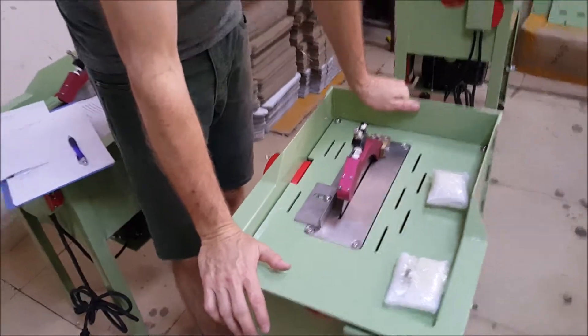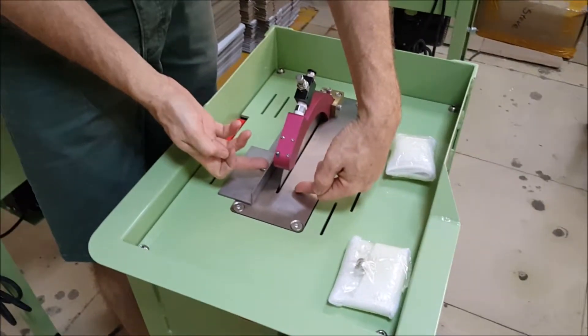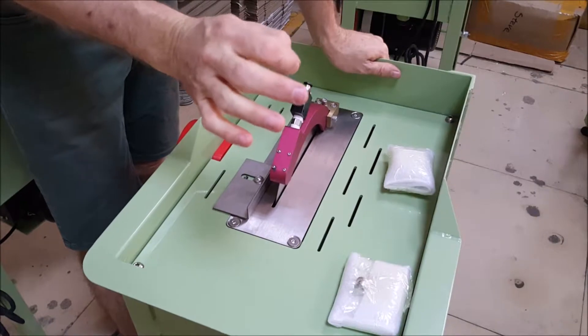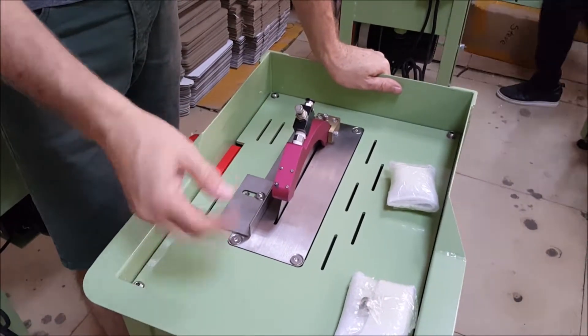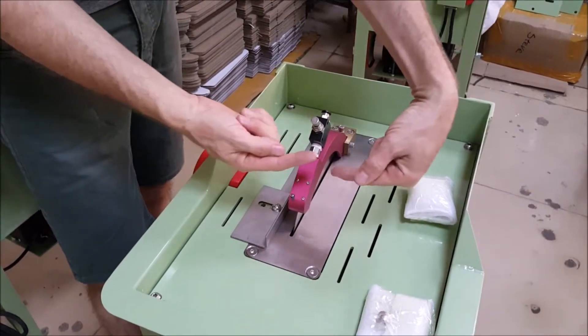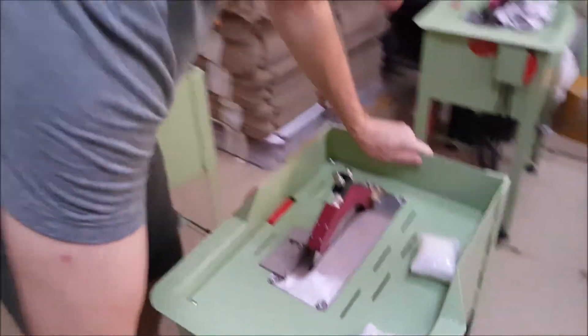Now when you fire up your PT, you're going to hear a scraping sound, which sounds like this. And you hear that kind of scrape — that's actually the two phenolic pins that sit underneath the blade cutting deck that stabilize the blade. Once you run water or a coolant in it, that sound is going to go away. But it's nothing to worry about. I make them a little bit tight so the blade is stabilized and you don't get any side-to-side deflection on the blade.